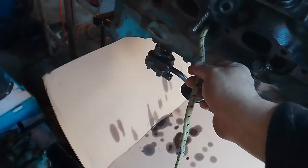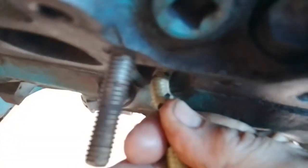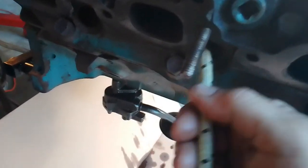So now we take the rope - it'll fit in the spark plug hole - and we feed it in. Right now we know the piston's at its lowest point, it's going to start coming up here soon to compress the mixture that it just charged in. Now I'm pushing and I can't push anymore. The thing to do is to not get confused by that - see, now it's going again. The big thing is when you feel this rope get tight to where it can't fit anymore in the cylinder.